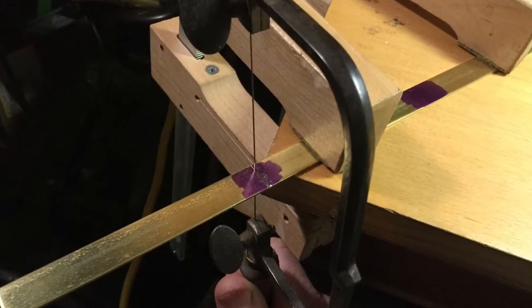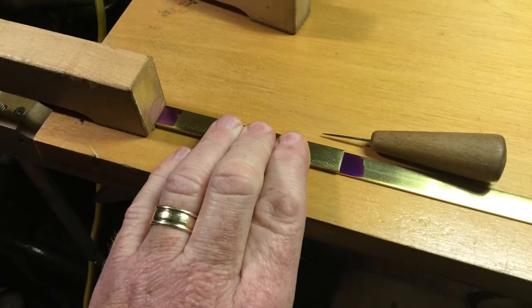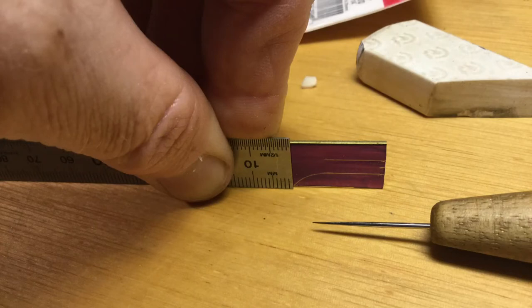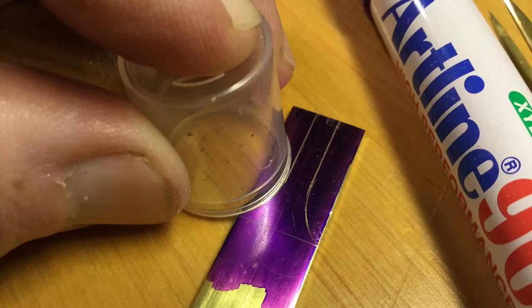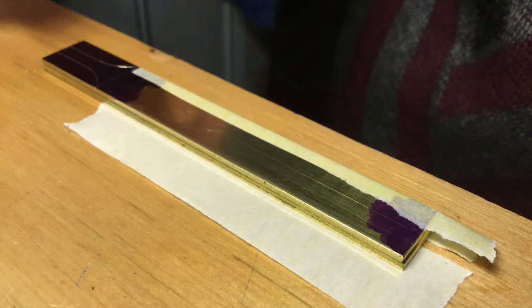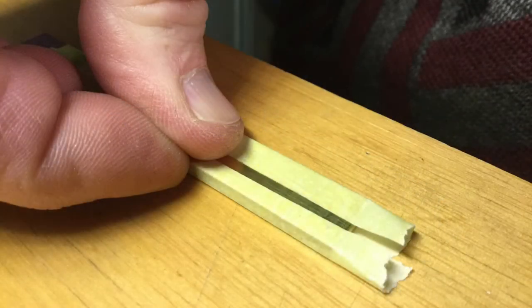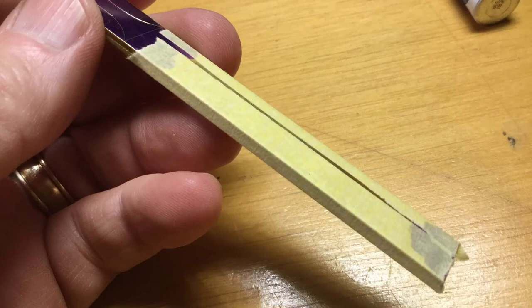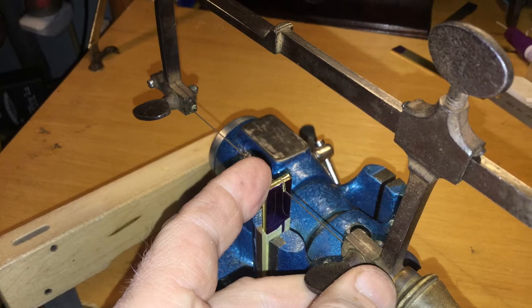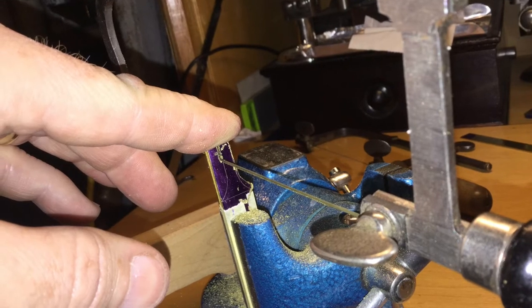Cutting off the first piece and then using the wooden clamp as a handy backstop when scribing off the second piece. I've marked out one side of the jaws and by placing the brass and ruler on their edge I can get a perfectly square line for marking out the end of the curve on the other side of the jaw. Then stacking the two pieces of brass and tightly taping them together making sure the edges are lined up. Then it's taking out the piercing saw and carefully cutting down next to the layout lines — this took a while as I was dealing with quite a thick amount of brass.